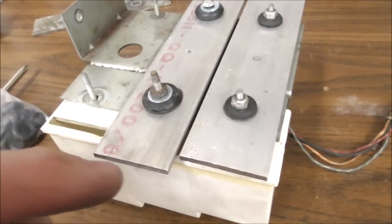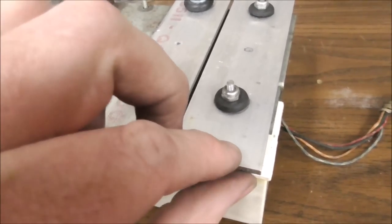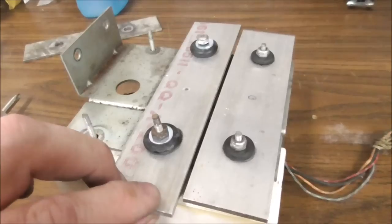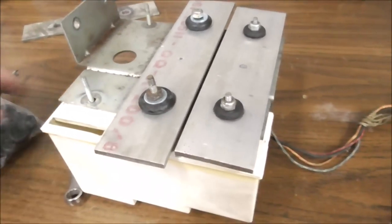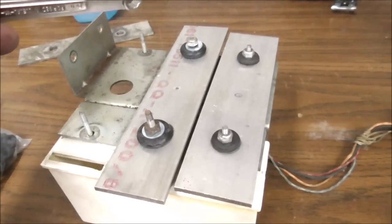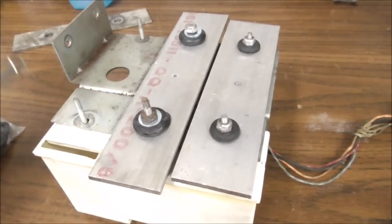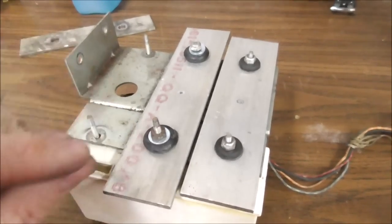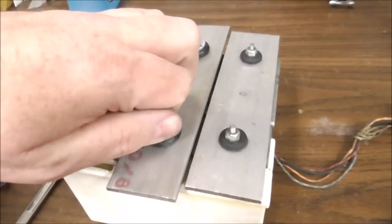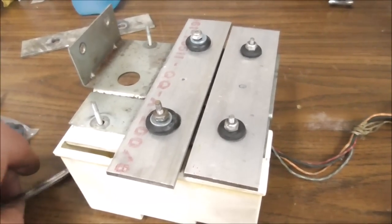Okay, I'm gonna show you what I mean about making it too tight. So this one, with the original bushings, is a little loose. That's how it's supposed to be. This one, I've made new bushings, and I've got it tight. So listen to the difference in the sound. It's too, what do they call that? Attenuated. It's got a damper on it. So you want it a little loose, right? So if it's a little loose,